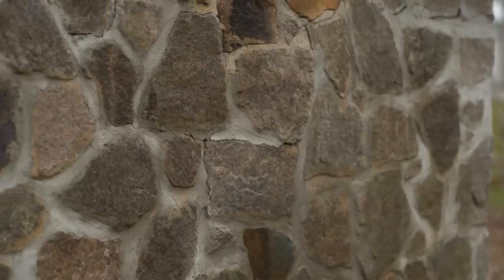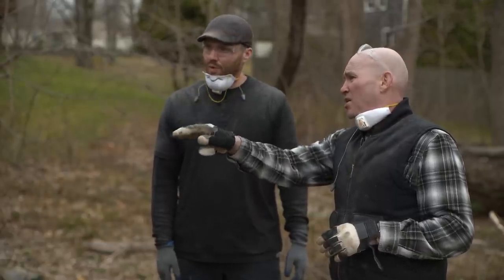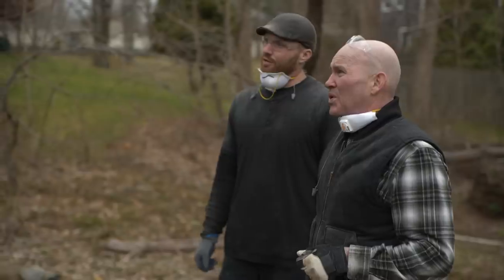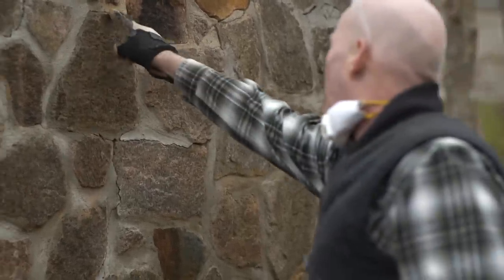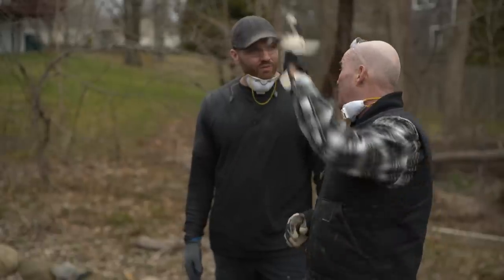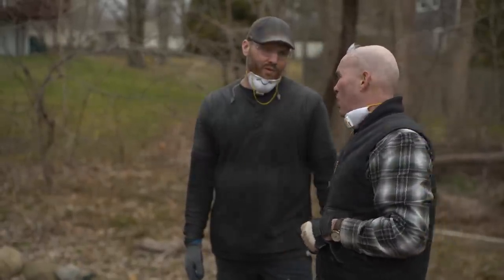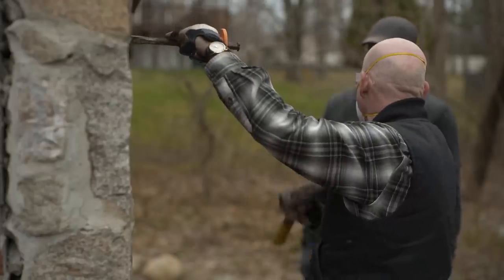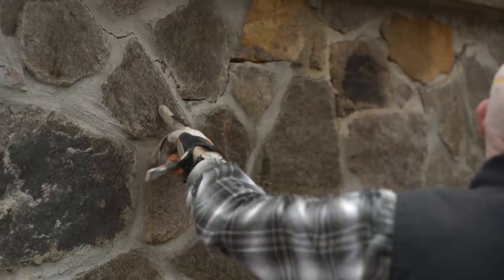This is a little bit of a different situation. We have the stone, so we're going to have to deal with the irregularity of that. The grinder is always our friend, but because of that stone, I think we're going to use a chisel and a hammer. It looks like somebody did this before — why are we fixing it again? Well, that's the reason we're here. You can see the old mortar and the new mortar that they put in. What they didn't do before they re-grouted everything was fix the original problem. So we're going to take all this old mortar out and start fresh. I'm going to be very careful, give it a light tap, take it away from the stone, and then smash it. That'll get the joint busted up and get me on my way.